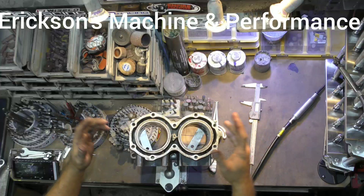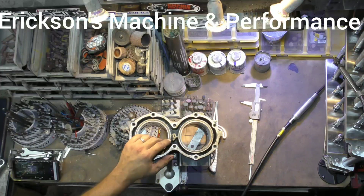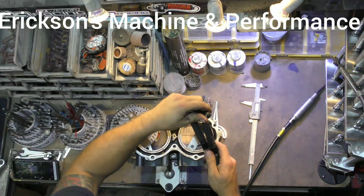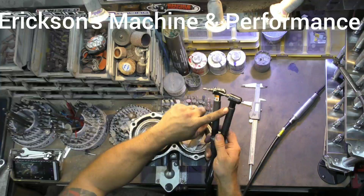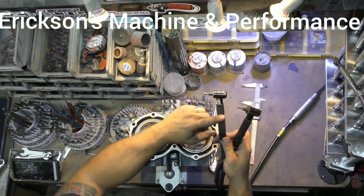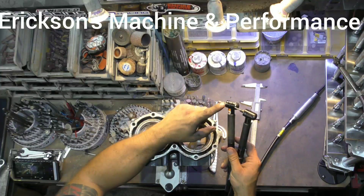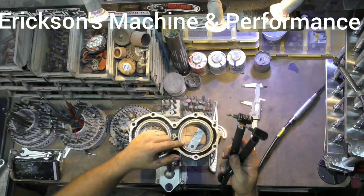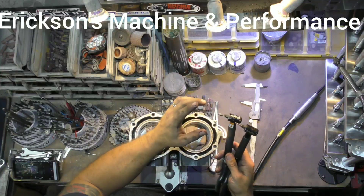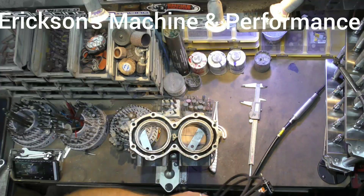Going through this video, you'll end up needing some grinders. The cheapest way to do it is to go with some air tools. When you're talking about the right angle tool, this is an Ampro and this is a Bluepoint. This one's $180, and this one's almost $400 — they're the same exact tool, the only difference is the warranty. The nice thing with these is you can get a 3 millimeter or a 1/8-inch collet. When you buy burrs, you'll notice there are 3 millimeter and 1/8-inch, and they don't fit each other, so you need individual collets. Getting a grinder that accepts both is really nice.